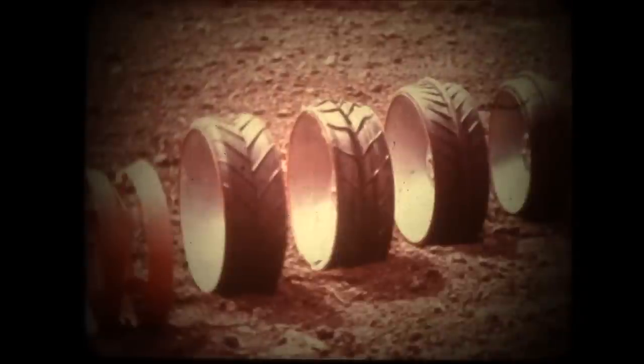Depth is easily adjusted by a convenient pin. Five different press wheels are available: the open center wheel leaves the row mellow for easy seed emergence; the traction tread tire firms soil over the entire width for mellow ground; the center rib tire compresses dirt directly over the seed and is recommended for no-till and minimum tillage applications; the dual ribbed tire firms soil around the seed and is recommended for conventionally tilled conditions.